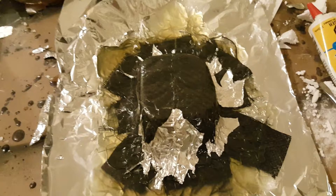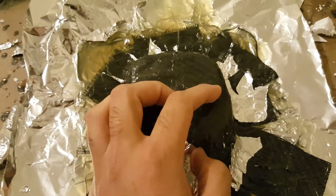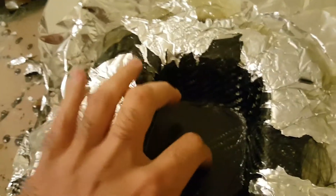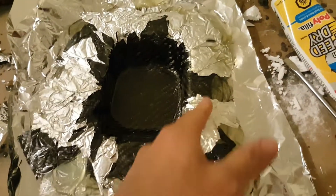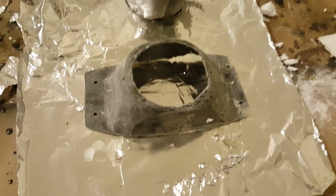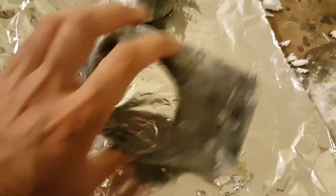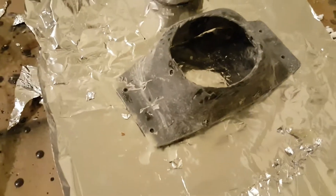After 12 hours, I tried to take off all the aluminum, but some of it had wrinkled up and wouldn't come off, so I'll have to sand the rest off. The surface isn't too bad — doesn't look great either, but it's okay. Once I'm done sanding all the aluminum off and giving the carbon fiber a better shape, I need to cut the excess carbon fiber off and cut a hole where the steel tube will go. After a lot of filing, sanding, and cutting, this is what the part looks like.